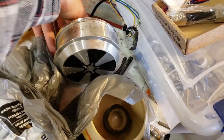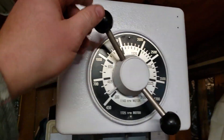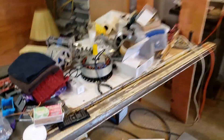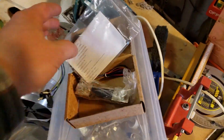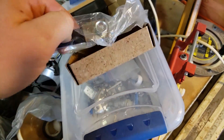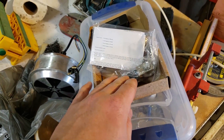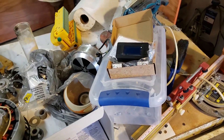I need to figure out a way to chuck all these up to my drill press, and then I can run dyno testing — my drill press is variable speed, so that'll work well. I can test them unloaded and loaded to see a voltage and power curve and a friction coefficient. I have an amp meter for that — I'll put a link in the description. It's a 100-amp, 200-volt meter; most you see are 60 or 100 volts but I needed 200 volts for my system.